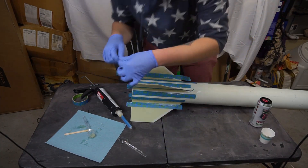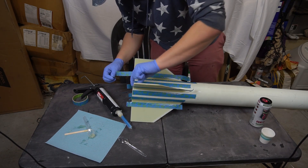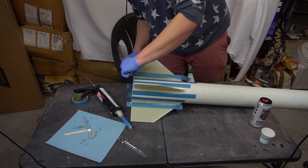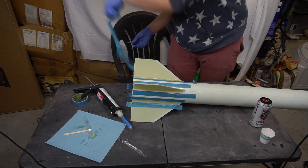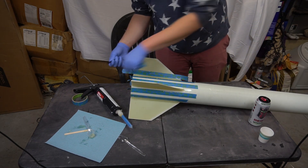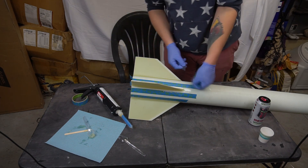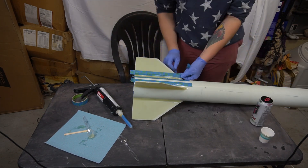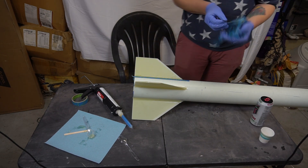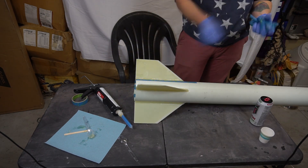The finger and the alcohol trick did in fact work, and this stuff cures quite a bit faster than West Systems with the slow hardener that I use. I believe it cures in about six hours with a full cure at 24. So after about three hours, I just put a glove on and dipped my finger in denatured alcohol and did some fine tuning on the leading edges of the fillets. That's a really good tip with just about any epoxy — before it completely dries out, get your finger covered in denatured alcohol so it won't stick too much, and you can use your finger as a clay molding tool.